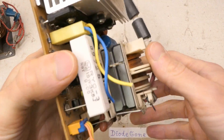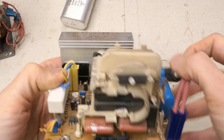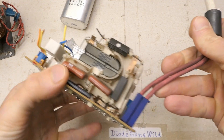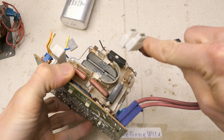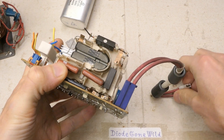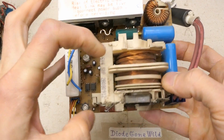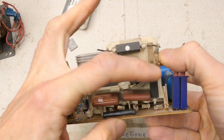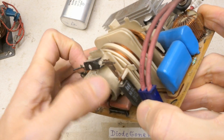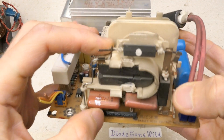I was donated just the power supply, not the entire oven. Let's explore it. It seems to have a heater connection — these two wires go to the heater end, with about 3.15V between them, but also about 4kV negative in the heater referenced to ground. There is a transformer, some high-voltage diodes very similar to traditional ones, but these have to be fast diodes because they rectify a high frequency instead of 50Hz.